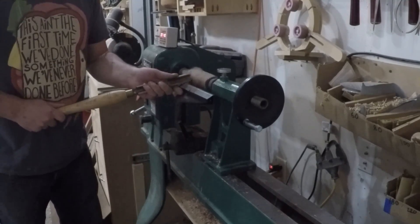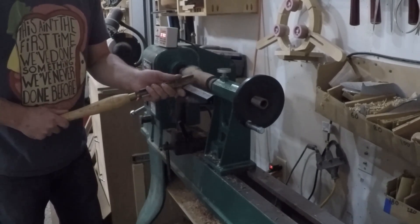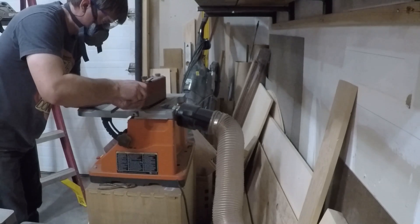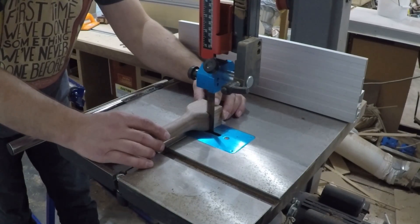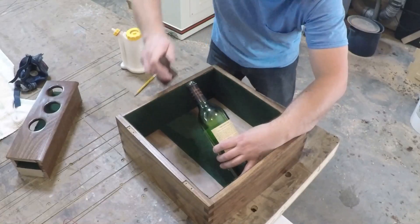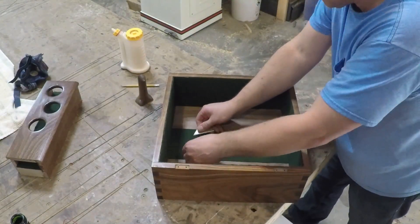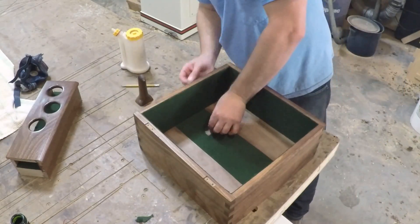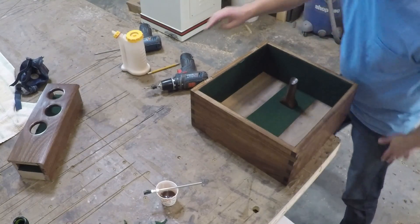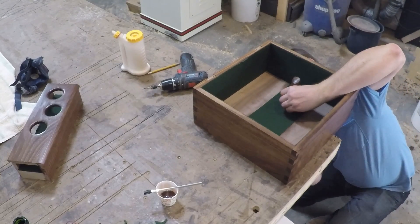One last piece I need to make is the holder for the whiskey bottle. I chucked up a piece of wood in the lathe and turned its diameter down just a tiny bit larger than the diameter of the neck of the whiskey bottle. Then I took it to the spindle sander and sanded a notch for the bottle to rest in. Once I was satisfied with the shape, I cut it to length on the band saw. I used the bottle as a gauge to help decide where to attach the holder, then cut a portion of the felt out so I could glue the holder down to the bottom. To be sure it stays put, I screwed it and glued it — the screw acting as a clamp while the glue dries. I used epoxy here since the surrounding felt would prevent the holder from sitting firmly against the bottom, and epoxy is gap-filling so it filled up the void.